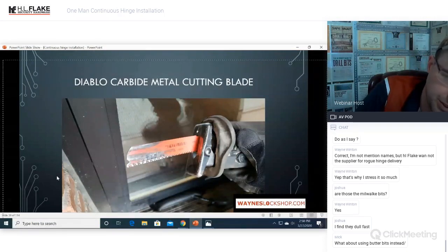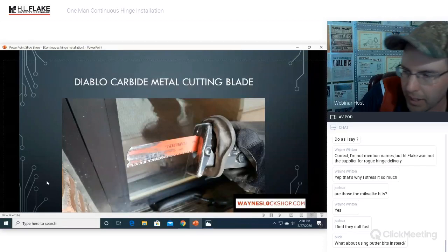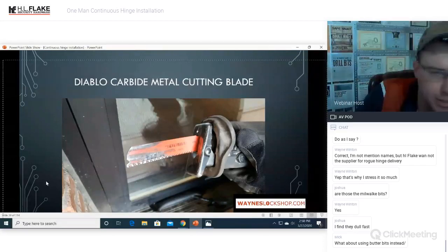Even the bolts, a grade 8 bolt is still only like 30 on the Rockwell hardness scale, whereas those drill bits are meant to drill out stuff that's like 60, 65, 70 on the Rockwell hardness scale, like safe hard plate. So hopefully that answers your question.